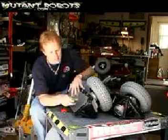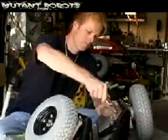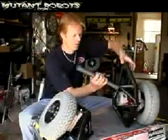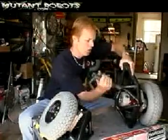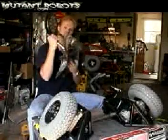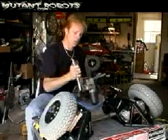This is 6061 aluminum. Doesn't that look nice? Now we're getting to the point where we're going to put the thing together. We have one chromoly rod which is our main spar, and then the second spar — which keeps the two halves completely level with this design — actually goes through the jaws and helps pivot them.